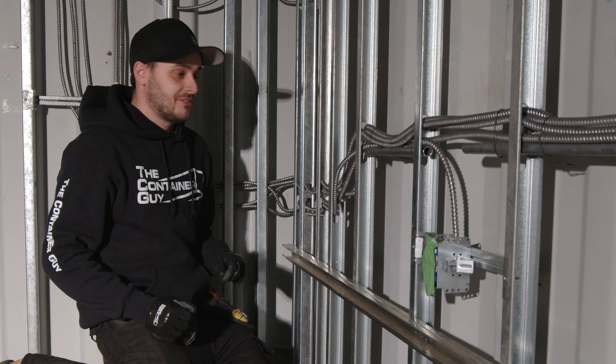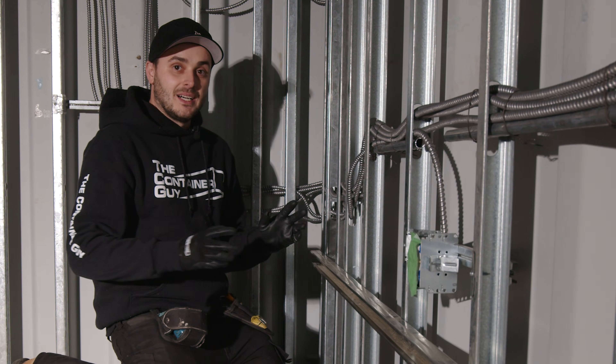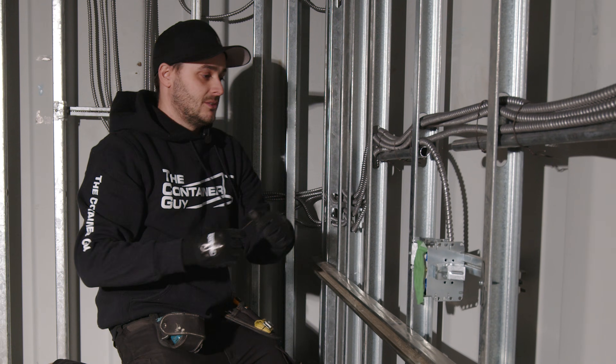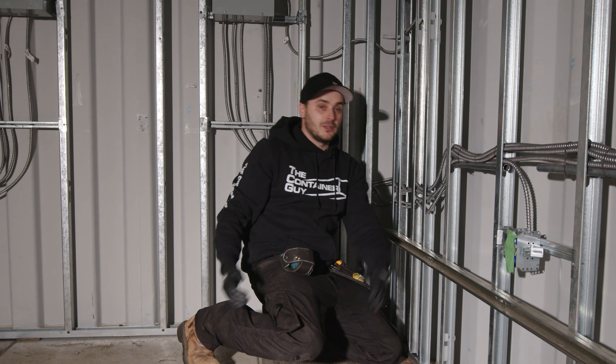This thing is pretty much ready for foam and this wire is sticking into the envelope. This is a prime instance of the problem. It's so easy to just miss this one wire. And if we don't grab a chunk of chicken wire or something and tie all these together and we miss this, we're not going to be able to put our plywood right over this.